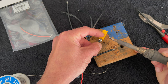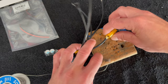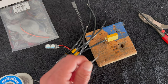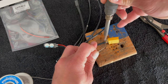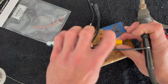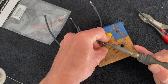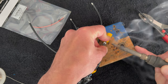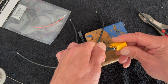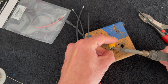You want to have a little bit of downward pressure on the wire because you don't want your wire floating around in the solder. If you get a little solder bubble in there and the wire doesn't sit down onto the connector you're doing yourself a disservice in power delivery and creating more resistance. I tin these guys a little bit just to help everything flow and meet together. As much as I say solder is a bad connector, I use it a lot - but getting the wire through all of that is the key; think of your solder like the glue that holds it all in place. Give those a visual inspection to make sure you didn't have any loose strands.